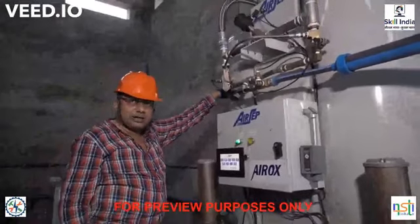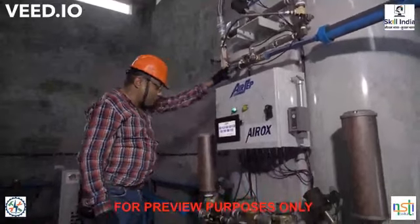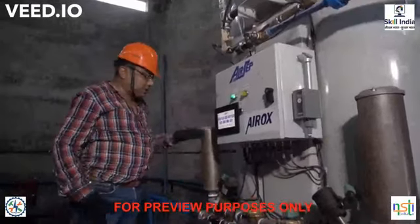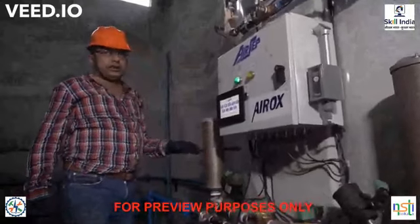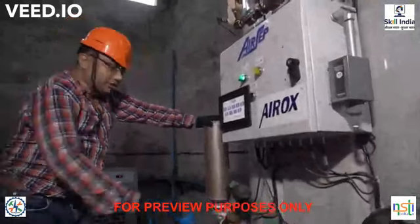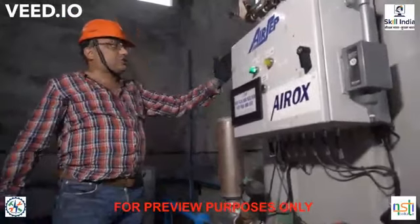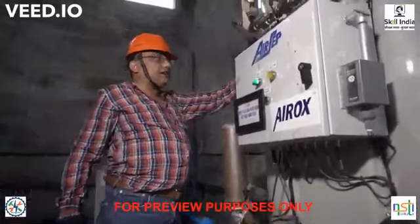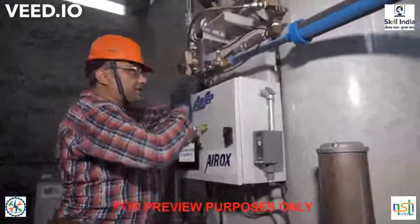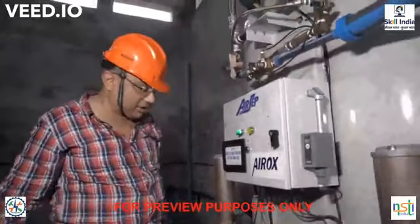A certain amount of oxygen from Tank B, now pressurized, will go from top to bottom — that is the blow-down process. This will desorb the nitrogen, so the reverse process starts: blow-down, depressurization, and desorption. The nitrogen comes out from the nozzle because V3 — that solenoid valve — is open. So one tank is having purging while the other is having blow-down — it is just the reverse sequence.